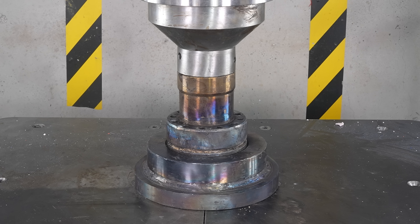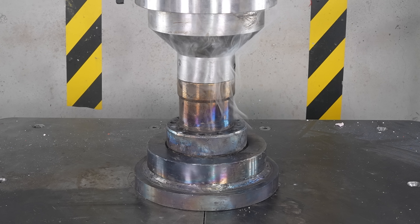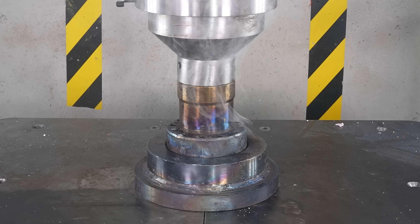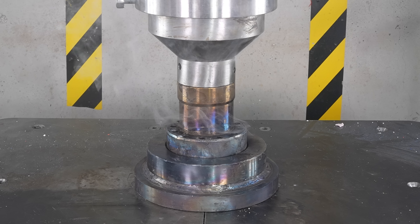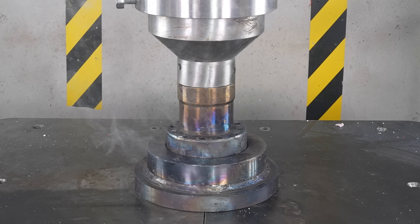And it didn't come out — and that's such a disappointment. I was really hopeful it was going to work. We were using 200 tons, because the tool attachment diameter is so small that it can't handle 300 tons — it's meant for the smaller press. So this temperature and 200 tons just isn't enough with this tool.